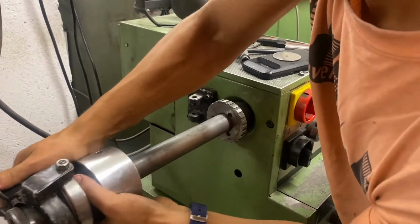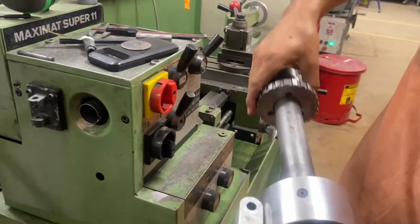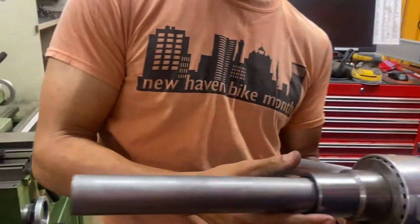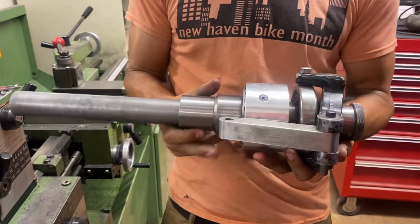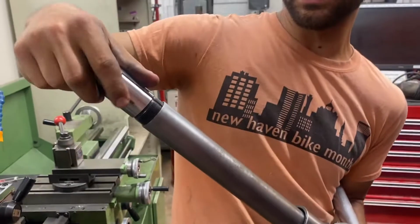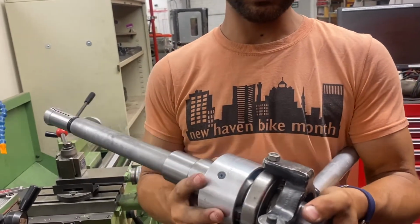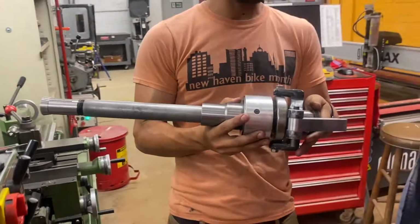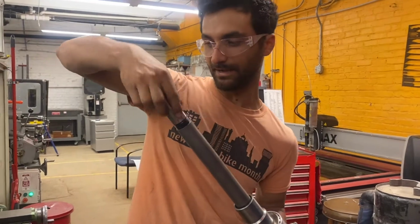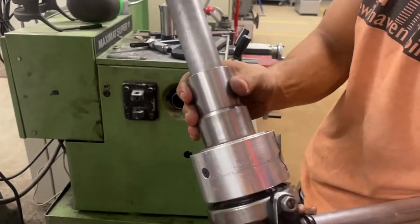So here we have this assembly, and we have this collet on the other side, and this threads into here. So first we disengage this from those teeth by pushing this pin. So now this can spin freely. And then we tighten onto here. So this pulls it in. And then we engage this, and what we're going to do is pull on it, and it'll add a little bit of extra snugging power to pull on this collet and tighten down on our material. So we're going to take that back out. This slides onto here, and in this hole.